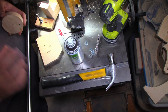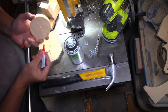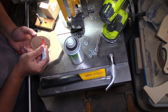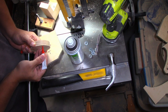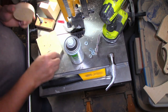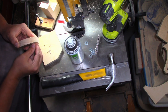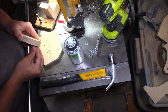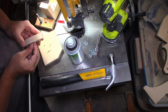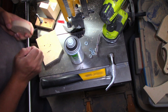If it grabs a little bit, it'll cut a groove into the bottom piece of the board. So I'm going to do the same thing. Super glue up to the hole. Squeeze until it just came out the other side. That way I know the whole channel has glue in it. Push it through till it just barely protrudes. That one's already locked in.